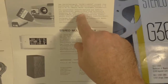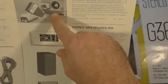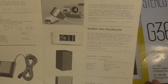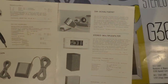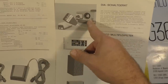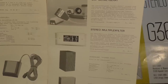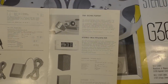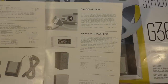Then we have the slide-o-matic. Slide-o-matic is something to control your slide projector — your slide viewer. The trick was to record music or voice on one track, and a special switching signal — normally a one or two kilohertz tone — that was received by this unit here. Then you could plug in your slide viewer and it advanced one picture when it received the signal. It was quite popular in the times when automatic slideshows were in. Today, of course, you do that on your computer — you play music, you make a video anyway, not a slideshow.